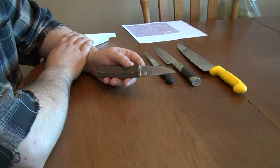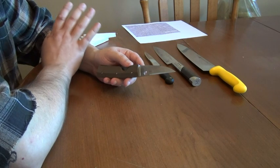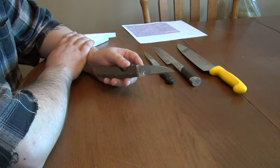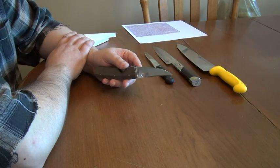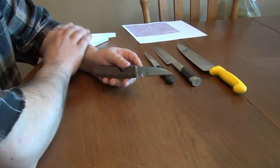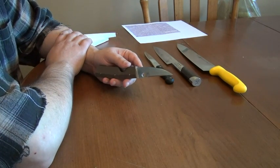Right now it's at the point where it easily carves soft woods like pine and can even do end grain cuts. Similarly, it can do moderate woods like basswood and again, even do end grain cuts. The edge durability limit right now appears to be around plywood and OSB, or any kind of knotty wood, where you use it at relatively high force — say around 50 pounds on a push cut — and you will get damage to the edge that you can see around one thousandth of an inch.